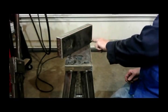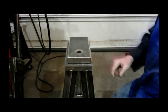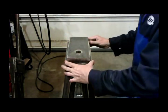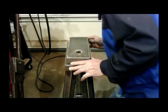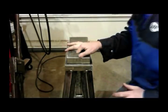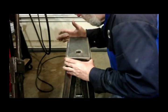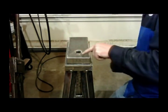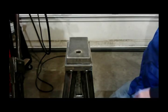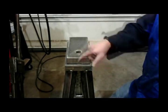I just got done beveling all the way around the bottom side of the top plate so that there's a little groove in there to put my first bead weld in. Now I'm going to line this up so it's clear in that bottom hole and straight and even up here and covering up the holes that go down into the tube. I'm going to put some big clamps on here to hold it so that it doesn't twist on me when I tack it down, and I'll tack all four corners and then go to town welding all the way around it.